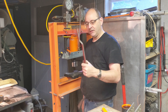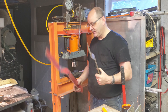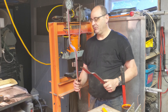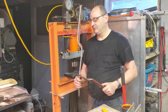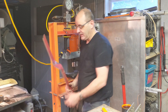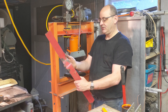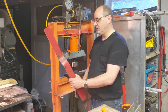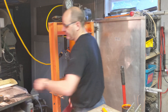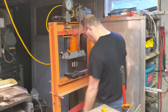This is the profile produced with the shop press with zero effort — something that I struggled with for 10 minutes a couple years back. So today I'm first going to be flattening the bend out of here to get it back to a flat condition, and then I'll be applying this dogleg like so.